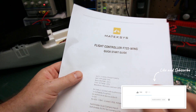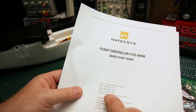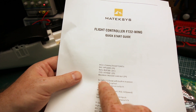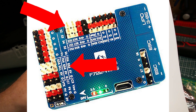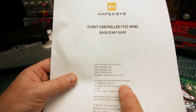The specs on this just blew me away. F7 board, so a very competent board. We have Baro IMU, the blackbox information, and five UARTs — five universal asynchronous receive and transmits: numbers one, two, three, four, and six. Important when you need to look at iNav for that. Built-in inversion on them — awesome, so we can invert those.